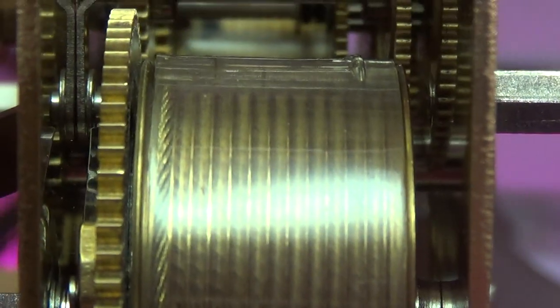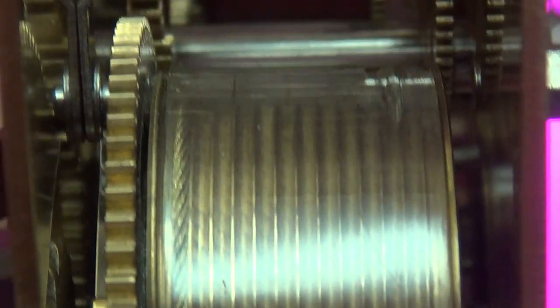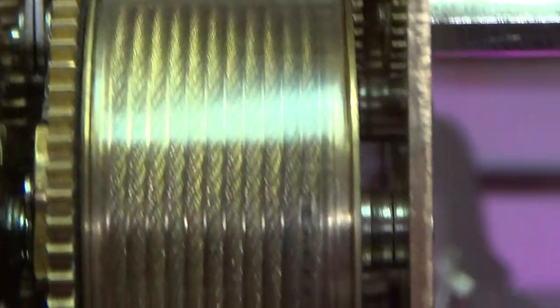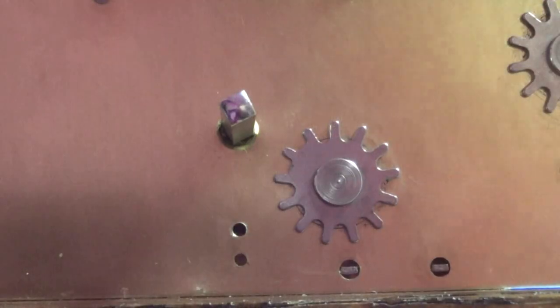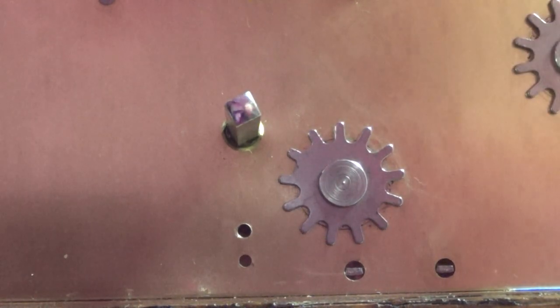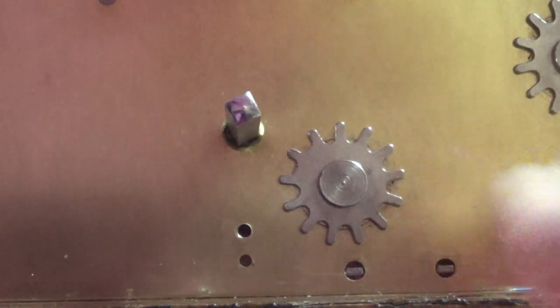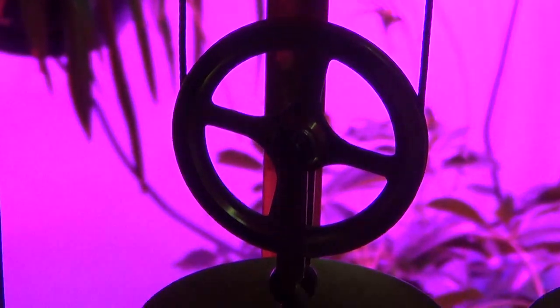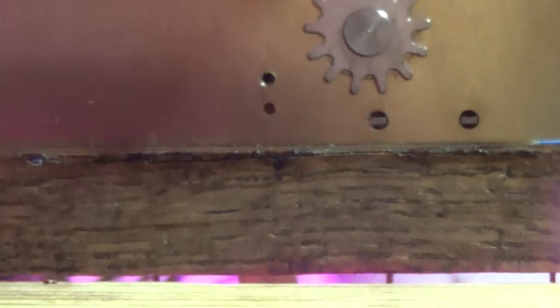Now I'm going to wind each of these barrels up until the barrel surface, the spirals are completely filled with cable. Barrel is filled to within one turn. All right. Well, setting up these winding stops or Geneva stops, we bring our weight up to where we want it, about 2 inches from the bottom of the board.